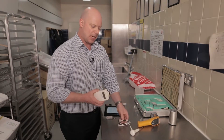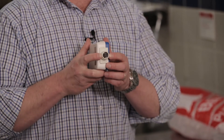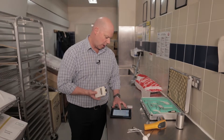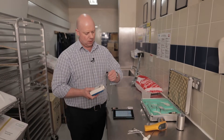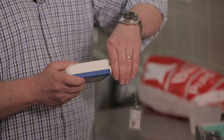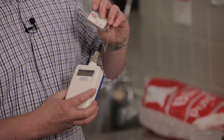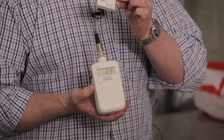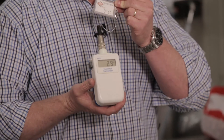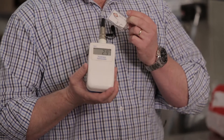To use these test tags you need one of these specific thermometers — they're the only ones the test tags fit into the top of. The first check, as it's on the log sheet, is the 3-degree test piece. We grab that, put it into the digital thermometer, and do it up tight to make sure it's got a tight connection — if you don't have that tight connection it's probably not going to show accurate details. You turn on your digital thermometer and, because it's electronically calibrated, it's telling me this digital thermometer is at 2.9 degrees. We don't need it to say exactly 3 degrees — the accuracy for these test tags is about 0.3 or 0.4 degrees, so as long as it's within that we're very happy the digital thermometer is accurate.